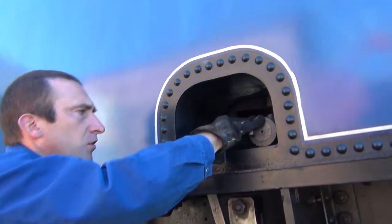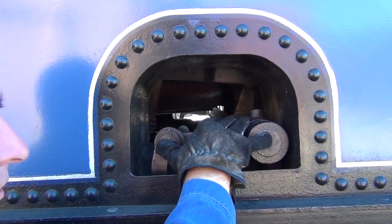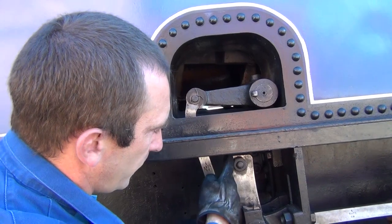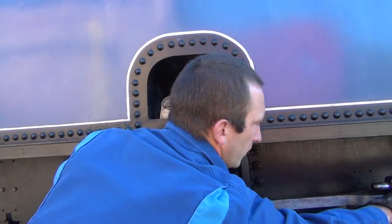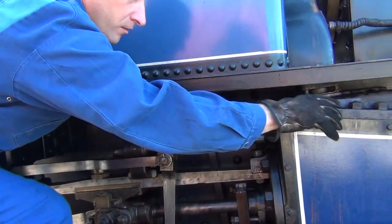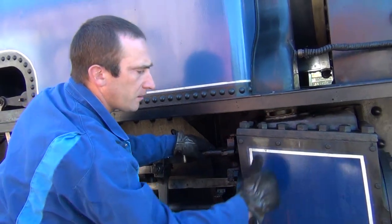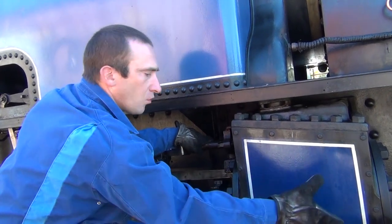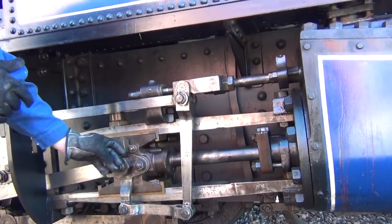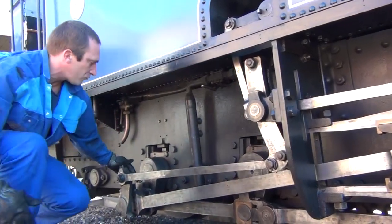Here I have my cabin control. When I showed you the reverser at the start, which is at neutral, I command this lever which can be moved up or down, which moves this piece in the slide valve and thus gives more or less stroke on this axle, which directly controls the steam distribution. It is a valve that moves to admit steam either from the rear or the front of the cylinder — the big piston — which gives the force, and this force arrives on the axle linked to the slide valve and to the main connecting rod I showed you at the very beginning.